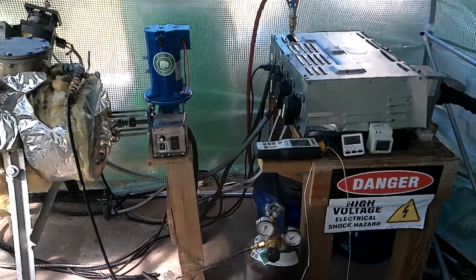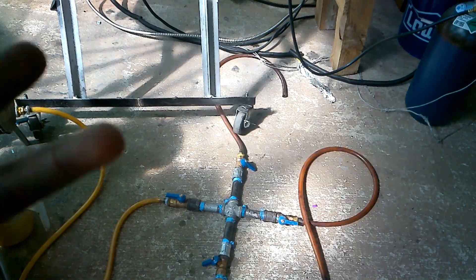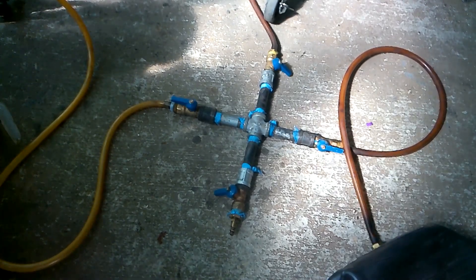At this point I do want to let you guys know I had a major issue. After I spent all day shredding all that plastic and getting this thing started, a magnetron broke. So we only had two magnetrons — literally two-thirds of the power we normally have. But regardless, the gas output was crazy. I lost track of time running this at night and had to stop when I fell asleep, then started again in the morning. 28 kilowatt hours consumed so far with two magnetrons, and almost no vapors being formed anymore. The internal temperature never really got up as high, and the pipes never got as hot, so we definitely got a lot less oils.